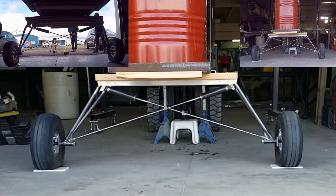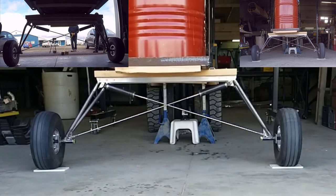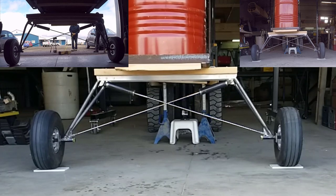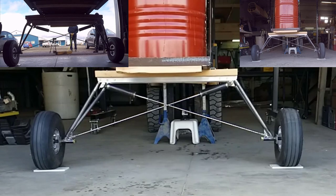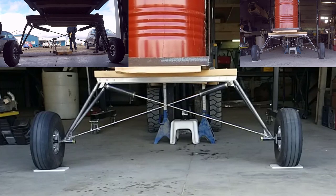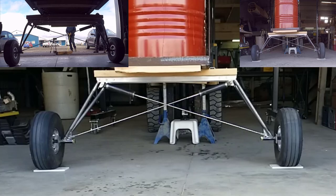We had plastic under the tires to allow them to slide laterally, and we found that we didn't bend anything, and that we had a really good rebound of about 8.5 inches. But then the second one was only an inch, so we don't have a lot of cycling rebound. We looked everything all over after the fact and found that we had no damage whatsoever, and then everything sprung back to the proper positions for the long term. So we found that this was a very successful test.